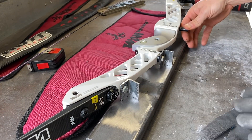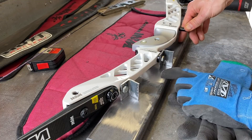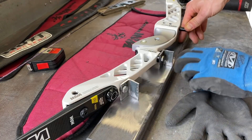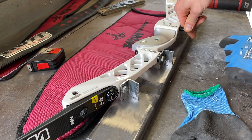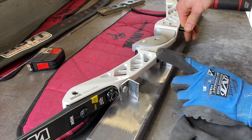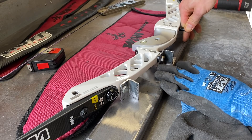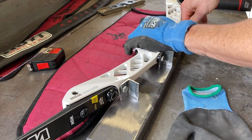I'm going to set up my welder. I'll be TIG welding today because I don't want to MIG this and throw slag and sparks all over the place and ruin the paint and the limbs. I'm going to hold the riser in place, tack the three brackets in place, remove the riser, finish weld everything up, and then once it cools, bolt the riser back down to make sure everything is still good and hasn't moved. Once I'm done with that, I'll build the arm for measuring the limb tip.